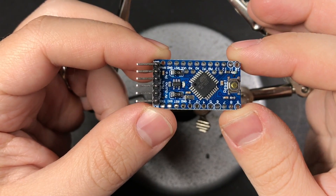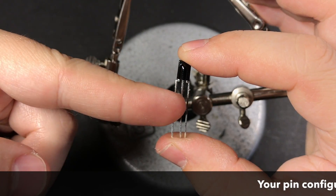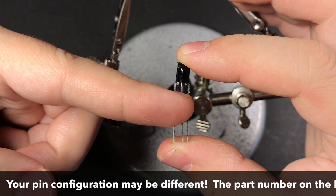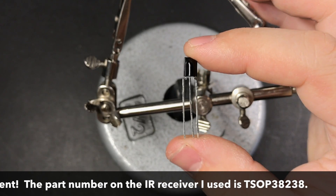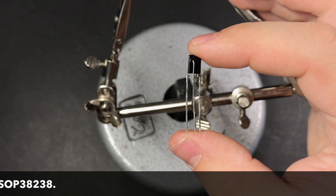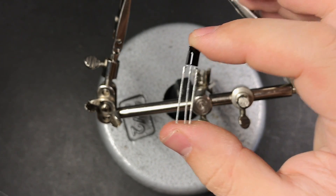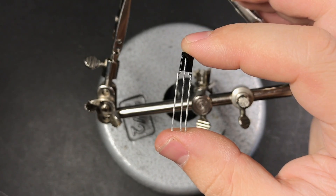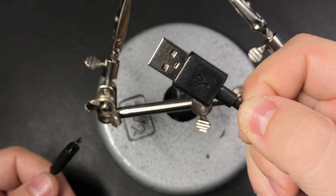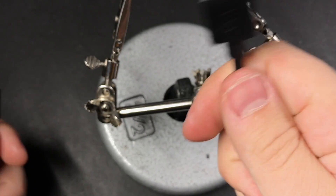Go ahead and program the lamp sketch. Then we'll connect the infrared receiver: the middle pin goes to ground, the left leg goes to pin 11, and the right leg goes to one of the VCC pins on the Arduino board. You have a couple of options — you can either embed it directly in the side of your project box if you want that to be what you shoot at with your zapper, or connect it to the end of a cord so you can place it somewhere other than wherever your project box is located. Since you'll need to chop up a USB cable to power the Arduino, I used the rest of that cord to extend the infrared receiver.